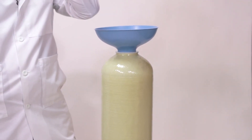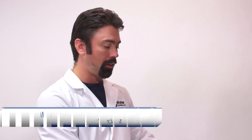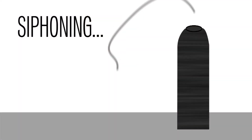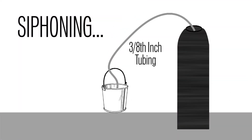After you unscrew the control valve, you'll be left with a tank full of wet media and water. Depending on how many helpers you have and what you have nearby, you may be able to siphon the water out first. You can use some 3/8 tubing — slide it all the way down the distributor and siphon it out into a floor drain or a bucket.